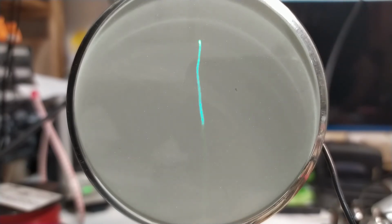What you can also see is, if I take this horizontal position control and just rotate it fairly quickly, this almost looks like what it's supposed to look like on a proper oscilloscope. So the only thing that's really left after we build a horizontal amplifier is to create a sync and trigger circuit, and then we could basically use this as an oscilloscope.